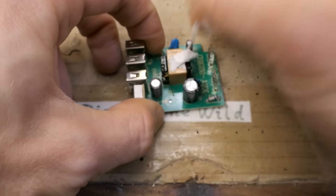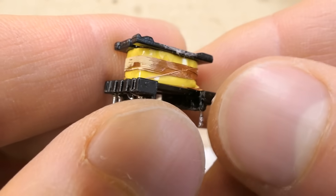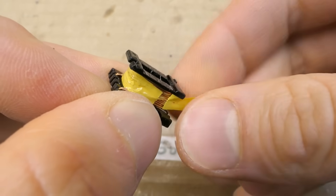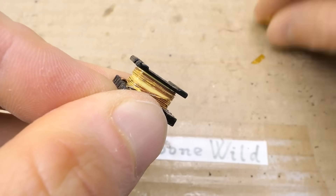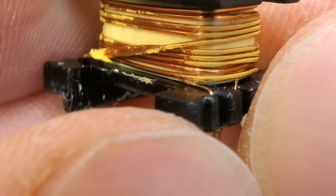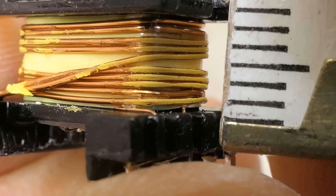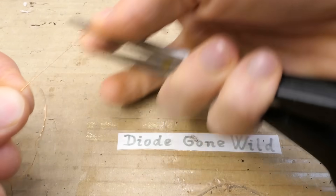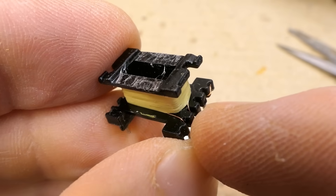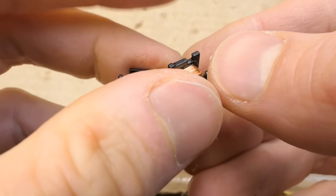Let's desolder the transformer — is there going to be any difference? The auxiliary winding is here. The insulation under it may be slightly less molten near the secondary. The synchronous rectifier actually helps reduce the losses and temperature inside. Here's the secondary — same construction as the other one: two parallel wires. The secondary is very close to the ends of the primary — it's almost touching here. This spot is really concerning — just about no distance between them. These are millimeters. Secondary removed and it's again copper. The insulation under it is nice, but it doesn't really help when the ends of the primary are exposed. The transformer is basically identical, other than distances between the windings randomly differing based on how they wound it.